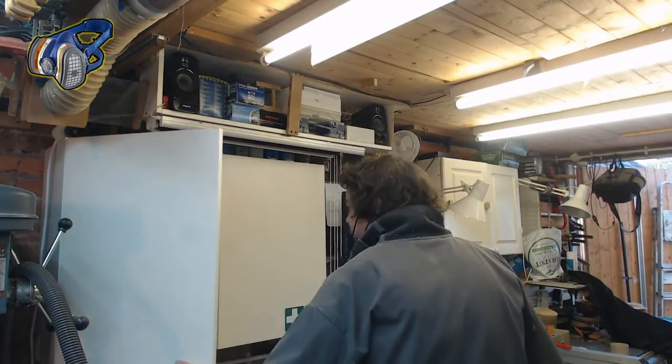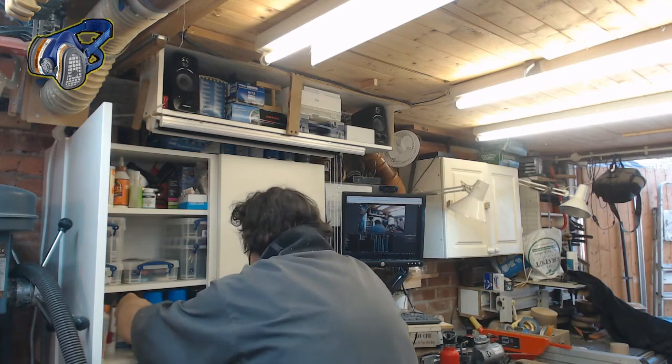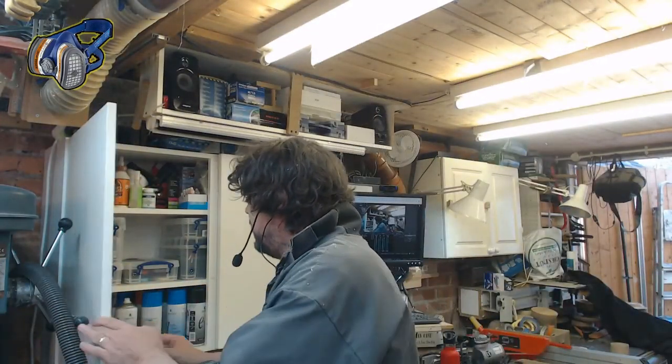I would always seal it afterwards, and the sealer I generally use is of course one I'm not going to be able to put my hand on. I normally use this, the acrylic sanding sealer from Chestnut, sometimes cellulose. If there's been a lot of stain on it and you put the sealer on, it can reactivate it and blend the colours together a little bit, thin them a little bit, almost like a distressed look, which is quite attractive.